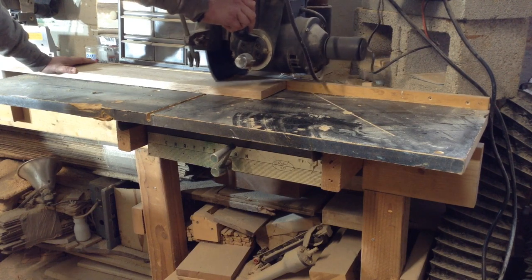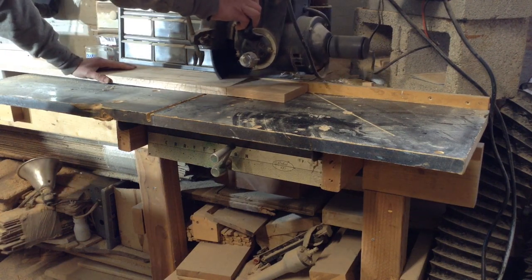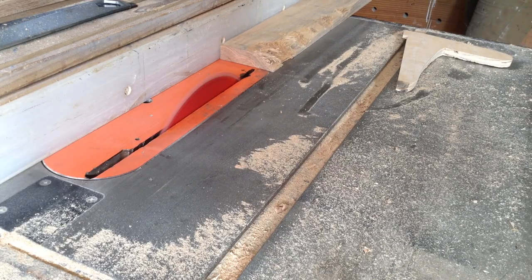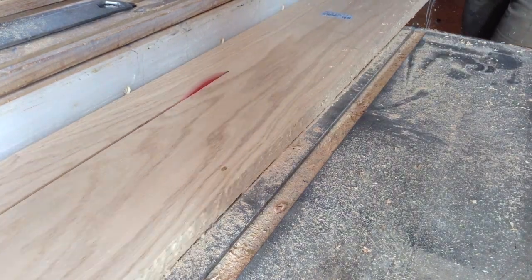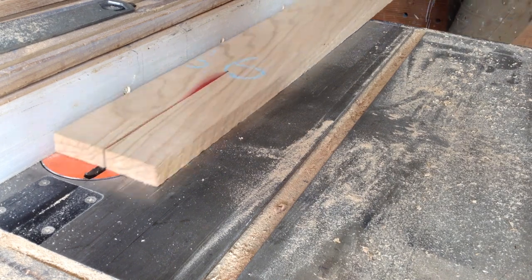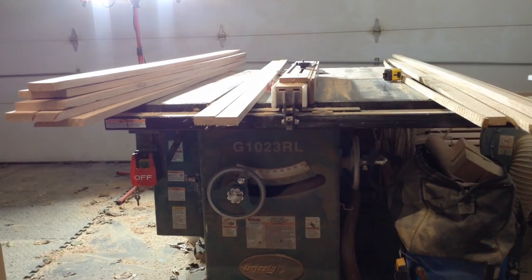Make sure you add on the depth they'll be going into the piece. This is a five-foot wide coffee table but the entire top has about a one-inch overhang, so the base is about two inches shorter in length and width. To start I'm just going to take these boards and cut them down to size and then rip them down to width. This is the beauty of lumber surfaced on three sides - one edge is already straight so I could take that straight edge to the table saw, rip all this stuff really quick, and save myself a lot of time on these bigger builds.